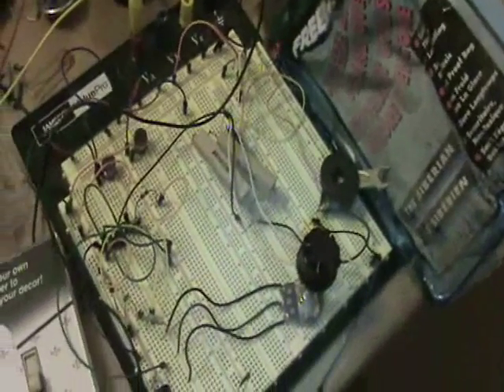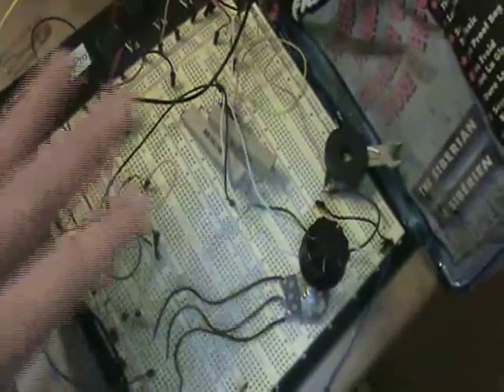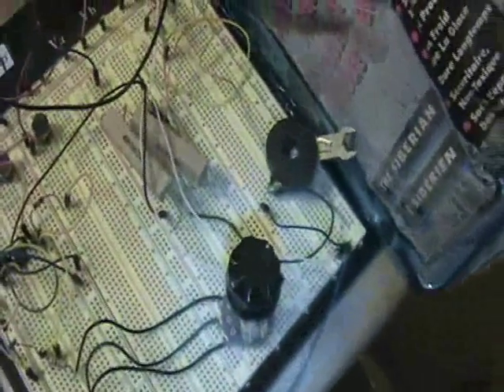Let me try to explain this setup. I've got my 555 timer circuit — this is my signal generator essentially. The transistor gets really hot because I'm going to be driving a solenoid that's very low resistance. So I have this cold pack here from my freezer to provide additional cooling.